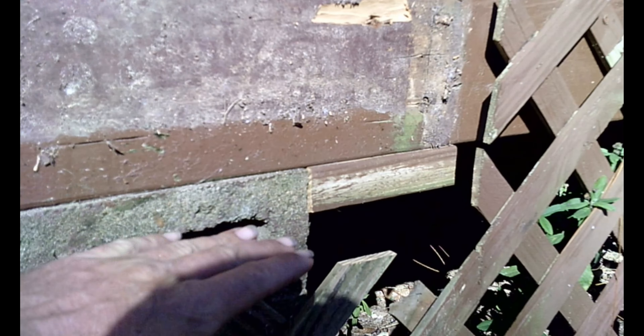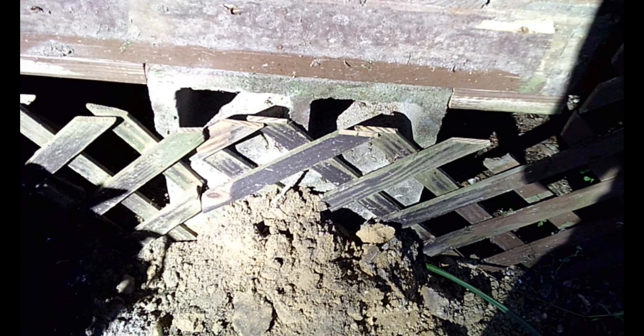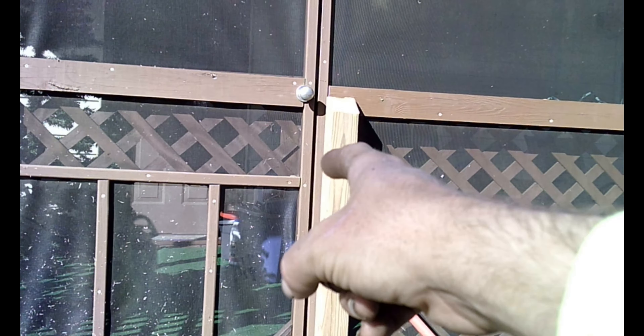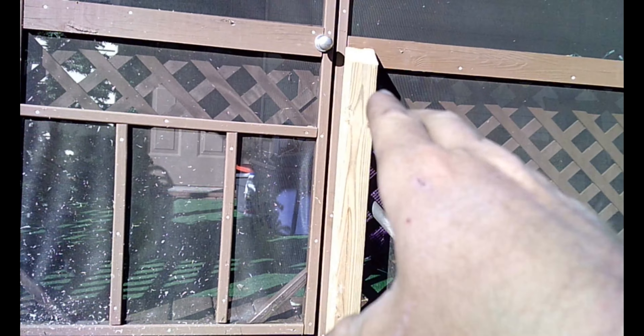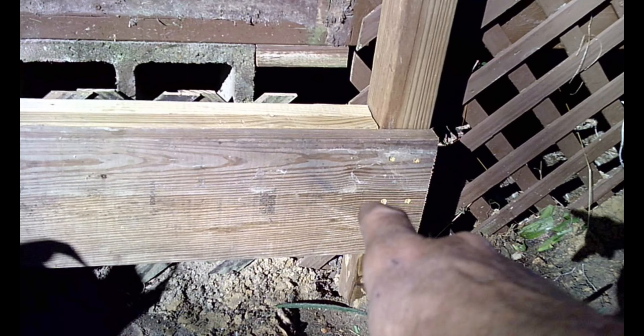I came in and added this two-by-four and that one because we're doing two eight-inch tall steps here to get up onto the porch. It was gonna leave an inch-and-a-half hole right there that would look kind of ugly, so we filled that in while it was nice and easy to get to. Now we're gonna dig another hole and set a taller post. My other post is set — I've got a little angle cut on the top to accommodate for the two-by-six I'll have sitting on top for the handrail — and we've attached this two-by-ten.